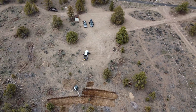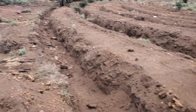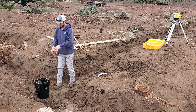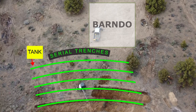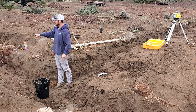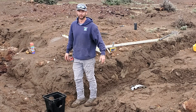Those drain field lines are running perpendicular and they are totally level, so I need to establish basically the grade at each box and make sure I've got a completely level line for the drain field. I am grading this first drop box because this one controls the flow from where the tank sits. Instead of just grading the tank and then figuring this out, I already have my trench established, so I'm carrying my trench grade to the box and then running that uphill to determine where the outfall is for the tank.